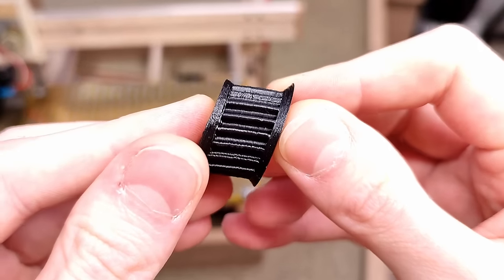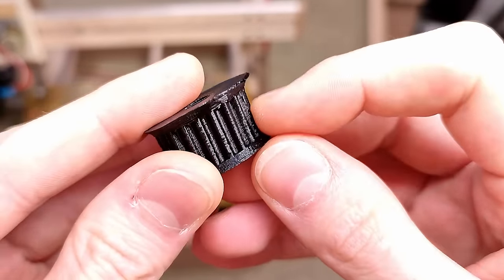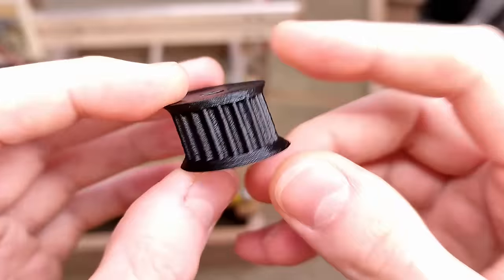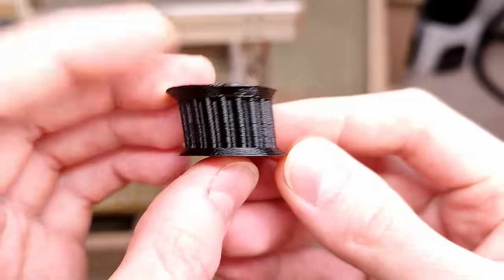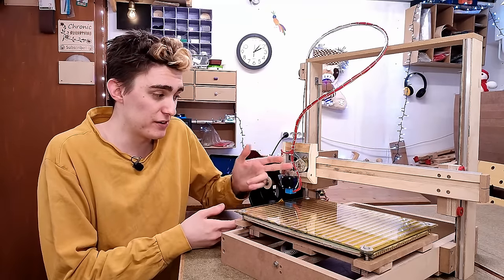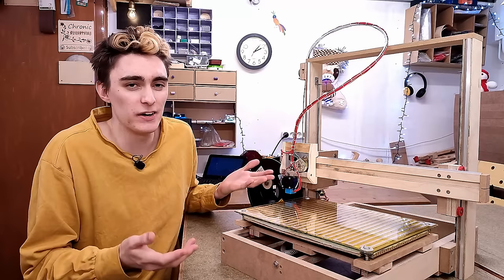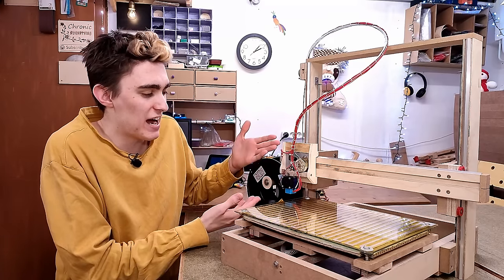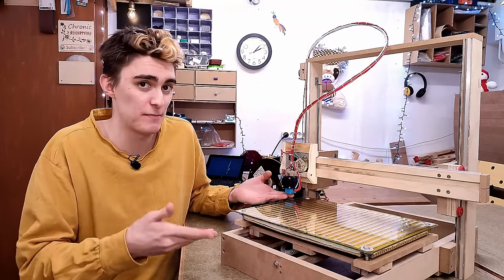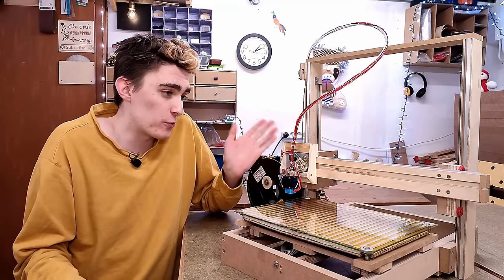There's still the same weird thing going on with the teeth, but because they're so much bigger, it has less of an impact on their shape. It's a shame, this whole resolution thing is so cursed because I'm relatively close but can't quite get there without physical modifications. I just can't really fix a mechanical issue of the motors and software, and even if I could, I would have an easier time doing it in hardware, because all I really need is to add a bit more speed reduction so the nozzle moves less distance for every full step of the motor. Half of what it does now would probably be acceptable, and a quarter decent.